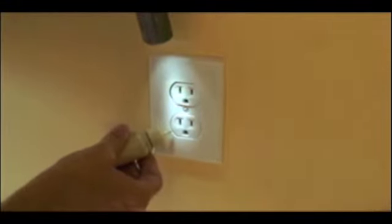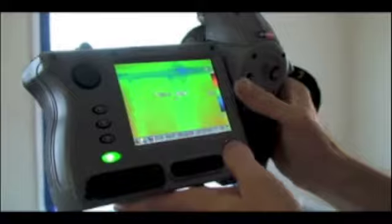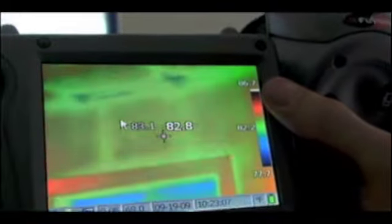And in terms of finding leaks, we were going around with the smoke pencil and the video camera and not finding many. Most of the electrical boxes were pretty tight. Laser pointer we're looking at. So this right here is a little bit of a weak spot in the insulation, but very, very difficult to do because of where it's at. And you can see this is probably where every one of the rafters meet the plate. Yeah. Looks like here. Got those. Oh, you can actually see, let me change the scale on this a little bit here. You can see the nails in the drywall. But the overall of this wall is quite good. The ACH natural, air change per hour natural on this house is 0.06.